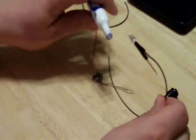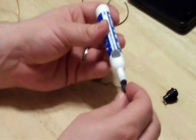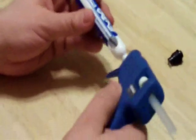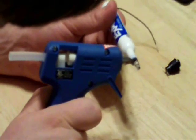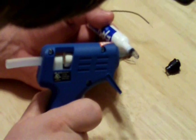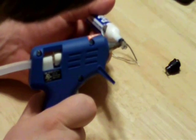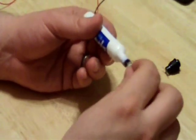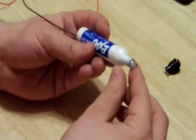Now we need to secure the LED into the tip of the pen. You will notice that I have wrapped both LED posts in electrician's tape to prevent any involuntary contact between the posts. Simply feed the long black wire through the tip of the pen until it comes out the back, then slide the LED posts into the tip, but not all the way. To secure the tip, I like to run a bead of hot glue around the base of the LED. The purpose of the hot glue is to secure the LED so that it does not slide out. Once I have enough glue on the LED, I simply push the LED into the tip of the pen and give it 5 to 8 minutes to dry.